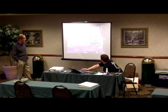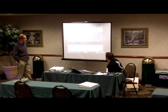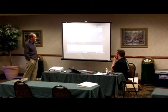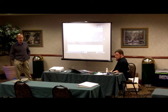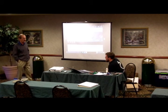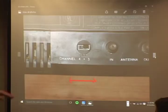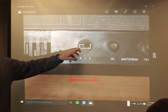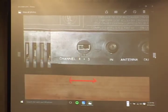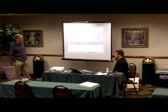Next picture. Oh, yes. You've got an FG player that works. You're using it on channel 3-4, but the picture is grainy, and it doesn't look that good. Good chances are that it's the switch here. Exercise it backwards and forwards and put some contact cleaner in the hole.